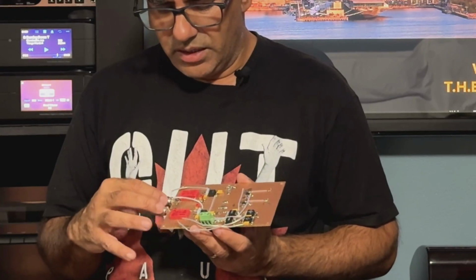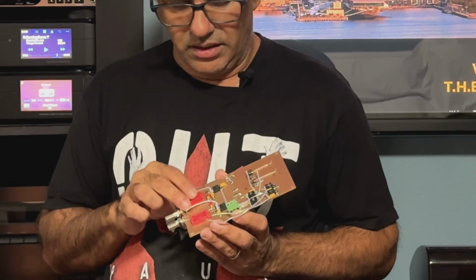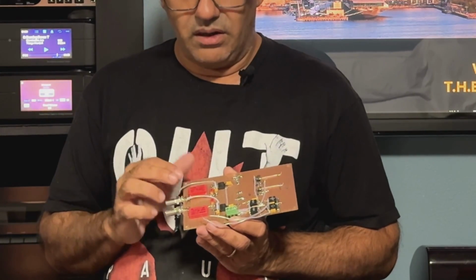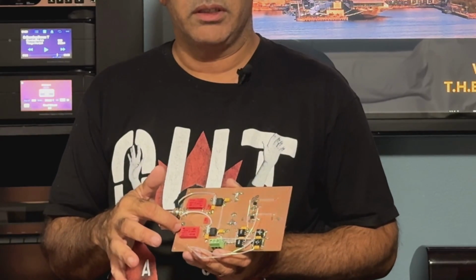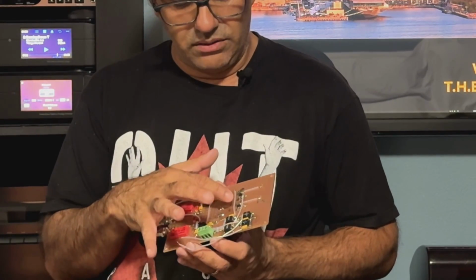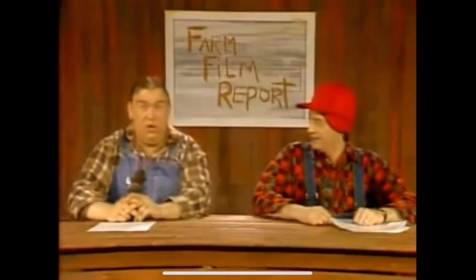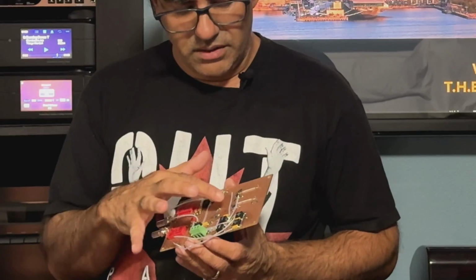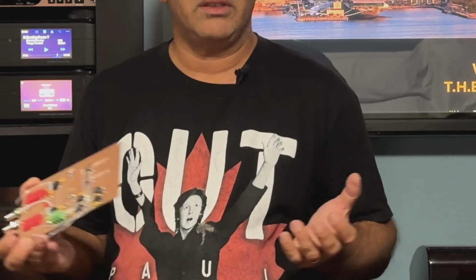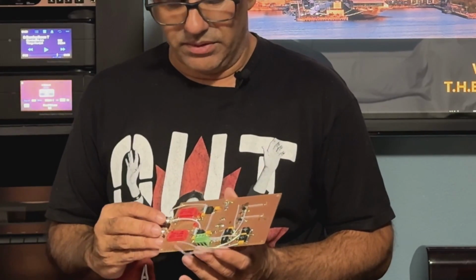So there are a few issues I've got to work on right now. An issue that I had in my original prototype: as soon as I go to connect the minus 20 volts here and here, all of a sudden my caps don't measure 16K anymore. They drop down to half, so I've got to figure out what's going on there. And the other thing is I've got to get the op amps working, because the first time I connected power to these, they didn't blow up. Everything at the end blowed up. Blowed up good. But I wasn't getting, one channel had nothing coming out and the other one was all attenuated. And it's the usual stuff. All you DIYers out there go through the same thing. You do everything as carefully as you can, but stuff happens.